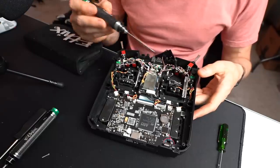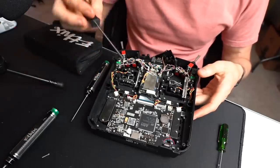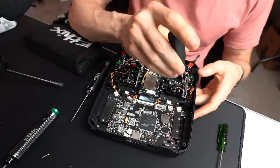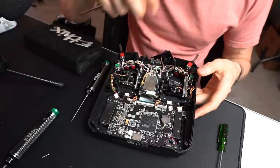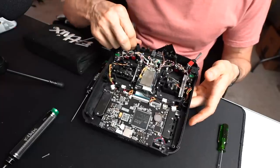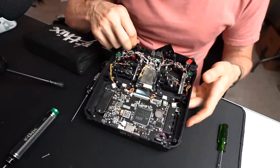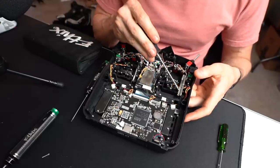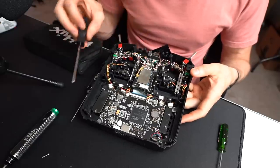What we need to do is get rid of the detent first. We're going to loosen the Phillips head screw on the outside — the one with that little notch — and loosen it until we have no more detent. We loosen it and now it's completely gone. Now the gimbal is a little bit floppy, so what I want to do is tighten the other screw, which is going to give us some tension in the gimbal by putting pressure on that smooth arc piece.